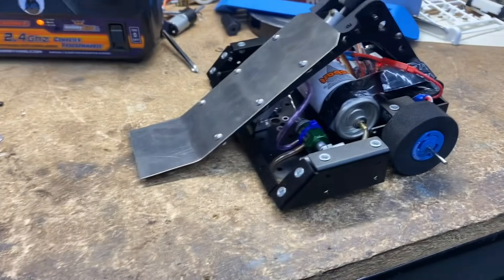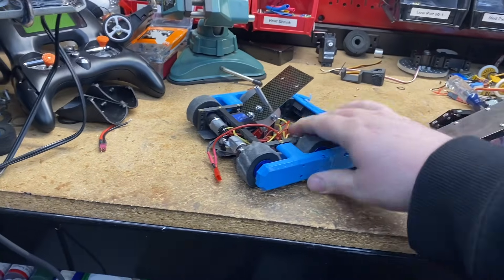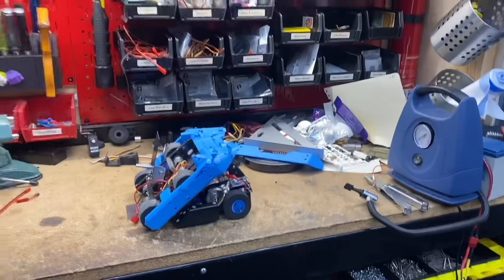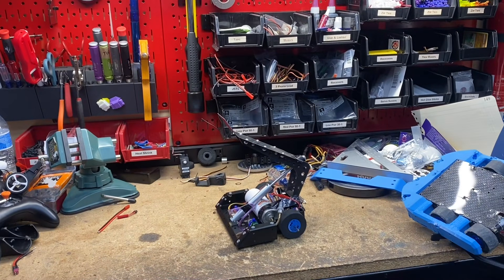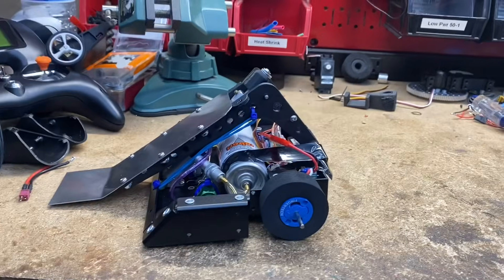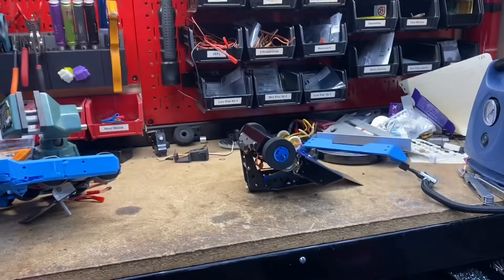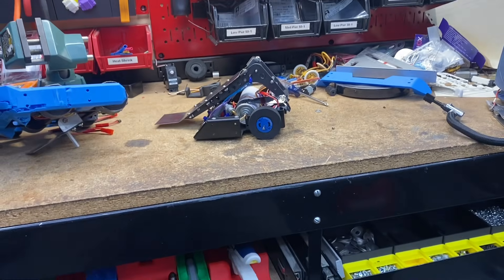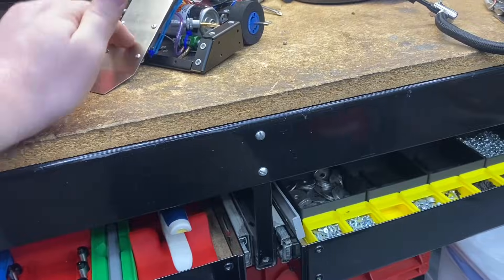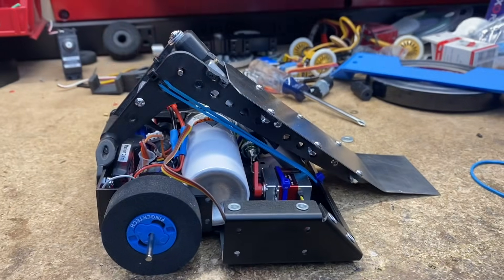Once you have a rigid structure — here's my one-pounder from last time. That was pretty good. Let's put it all the way on and see what happens. Wow! Time for the next test. I've added rubber bands. It totally works. Now with the return spring in there, I think I still might need a little more downforce — it's not quite making that last bit. We're just going to need a third rubber band. Move the rubber bands up a little bit.